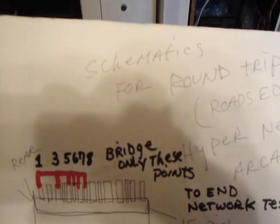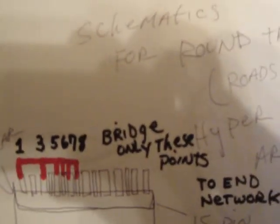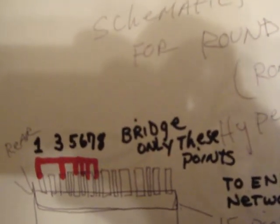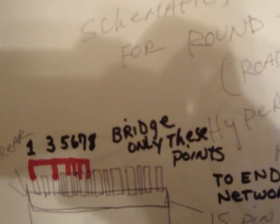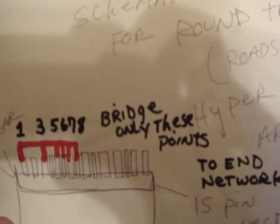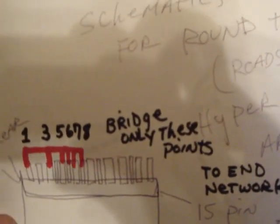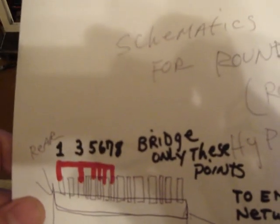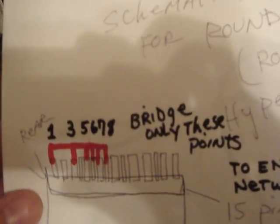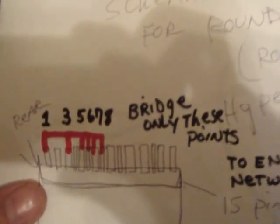I have them jumped. By doing this, you will get out of that test mode. When it originally starts up, it'll check to make sure all the boards are hooked up, then it goes into a network test. With everything wired up and those pins bridged, the network test will only last about 37 seconds, then it'll jump into the game. Without bridging, it goes to 99 seconds and starts over. First step: bridge all these points.